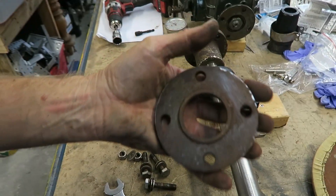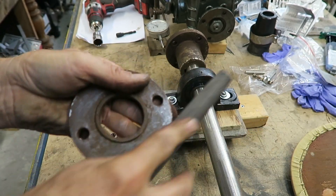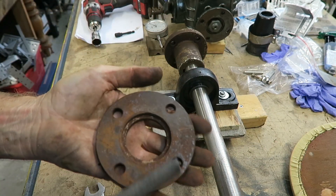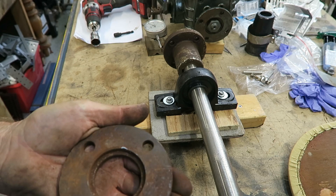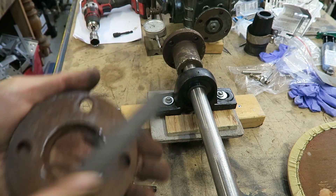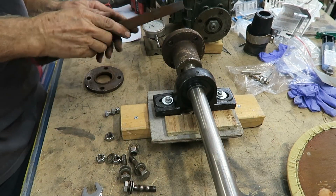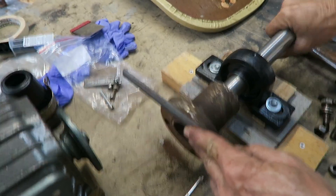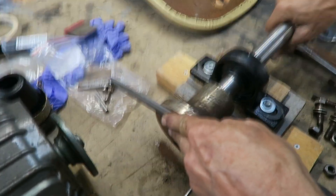I'll get a file and I'm cleaning off the rust. One of the things you'll note is the shiny bits around the edge — in particular that little bit there where it's been hit with a hammer or dropped or whatever. Those are high spots in the actual coupling flange. So as well as removing the rust, I'm just taking the high spots off the coupling so that they actually mate together properly. I'm doing this on all of the surfaces — it's probably a bit crude, but you'll see the result in a minute.